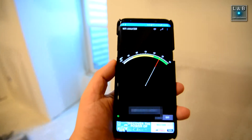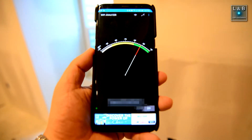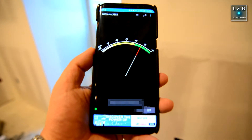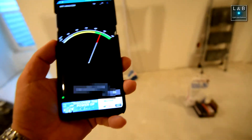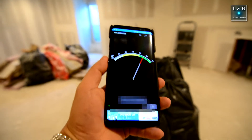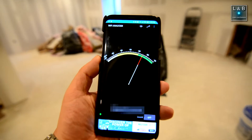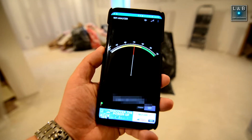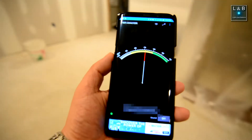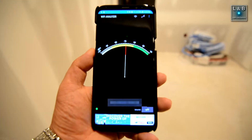Re-measuring from the basement now that the drywall is in — we're directly underneath the first floor wireless access point and it's doing pretty well. I'm going to start moving backwards towards the middle of the basement. You'll see there's the air duct on top, floor joists, drywall, stuff like that. Then you'll start to see the signal drop, hanging around maybe negative 65 to negative 70 dBm. If we continue back towards the corner of the basement you'll see more degradation in performance.